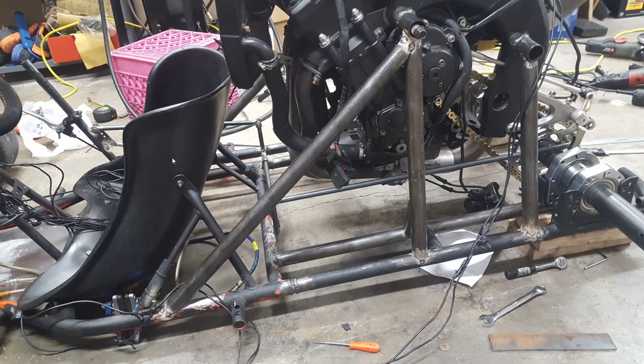Here I've also designed the shift linkage. Here's the shifter that can pivot — if I go back on it, the motion is transferred along this bar which transfers motion to this piece, rotating through these little oversized tubes. The same goes for the other side — this pivots backwards, transfers along here to the normal foot shifter on the R1. It goes back and forward, transferring motion into the shifter on a little shaft, which shifts the gear.